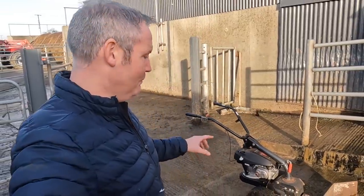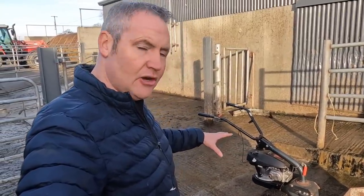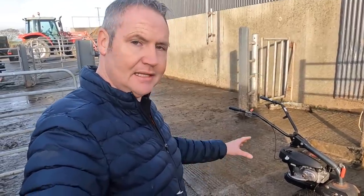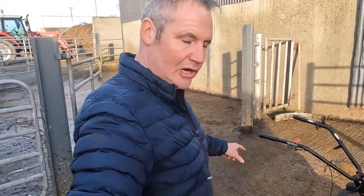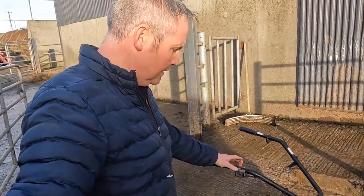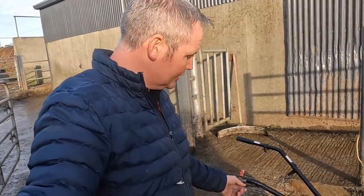Snapped. And you can imagine the colourful words that came out of me. Let's start with the amount of money we put into this thing. We changed the tyres. The tyres that came on it were a tractor style tyre. They perished and busted out of the sides, so we had to change them. Then we put a new rubber on it. That's a changeable part, we can't fall out with that. Then we put a new throttle on it because it snapped, with a real bad mechanism in the old engine leaving it too hard to move. It was plastic originally, so we ended up putting on a new lever here. A tenner is all that cost, not the end of the world.